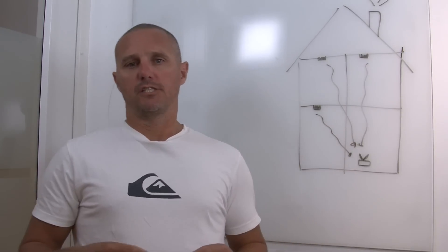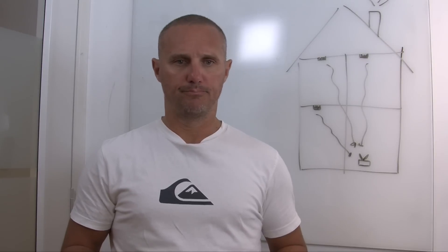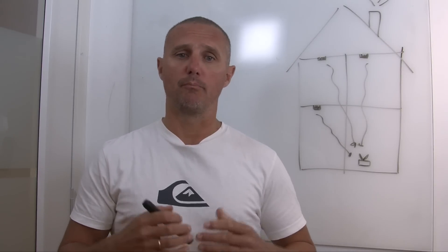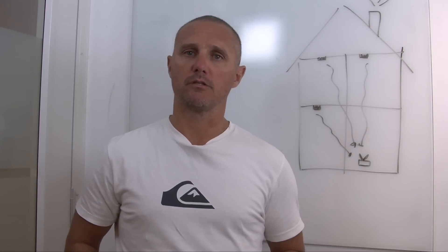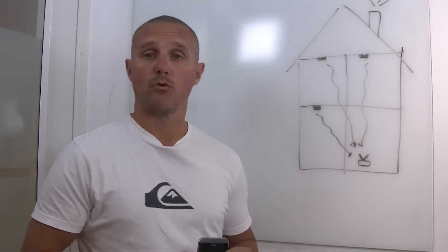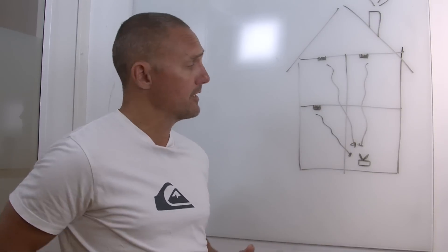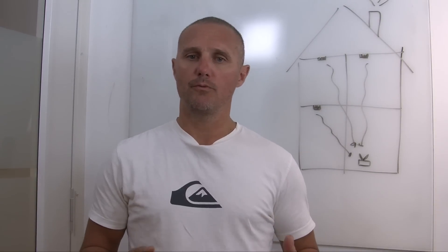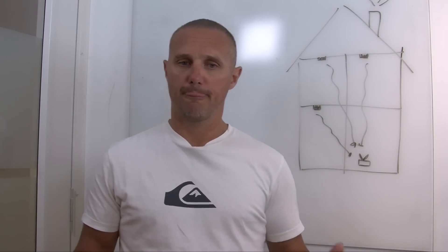With a dual-band device it is possible to do an over-the-air firmware upgrade using a BLE connection. The high data rate of BLE will reduce the power consumption and no special tools are required. You can simply use your cell phone or a tablet to update these detectors using 2.4 GHz. After the upgrade at 2.4 GHz, the device operates back on the sub-1 GHz network.